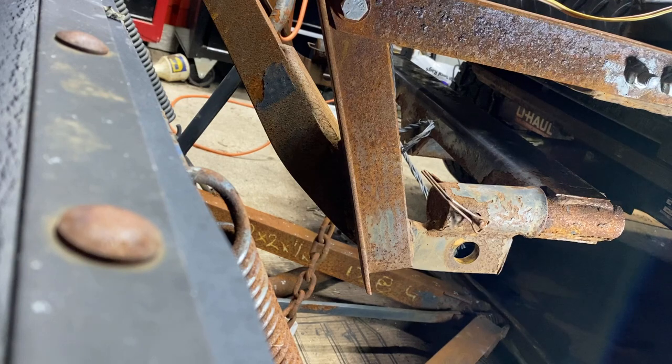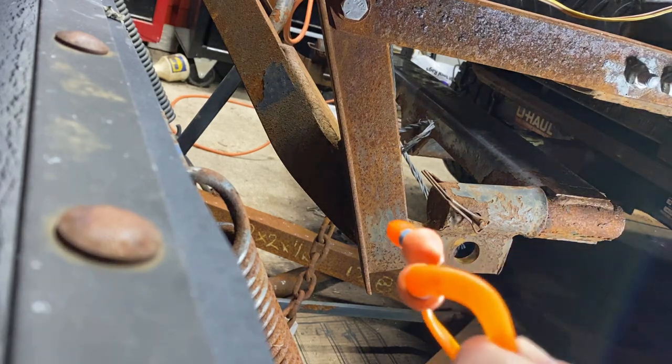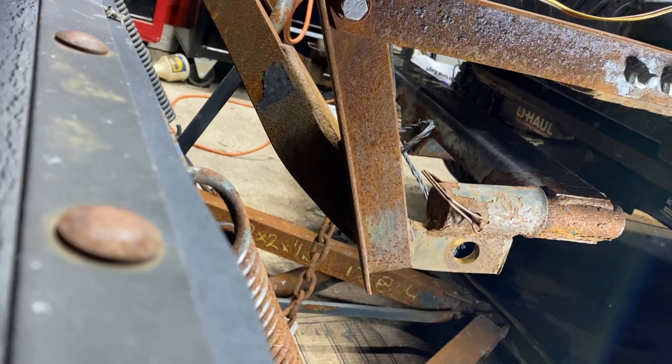All right, as we always state in our videos about welding and grinding, number one, be safe. I've got ear protection on and a face shield on. The second thing, clean up all the rust off. Make sure it's good and shiny so you get good penetrating welds.